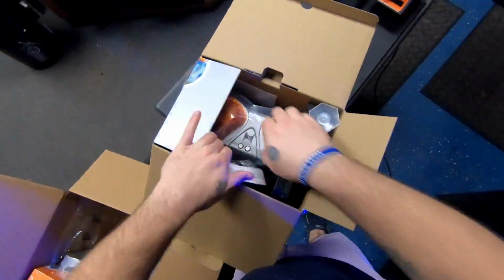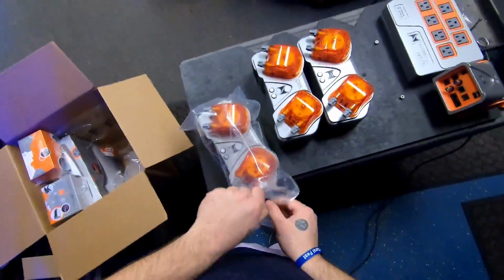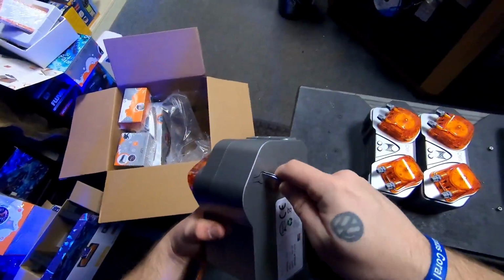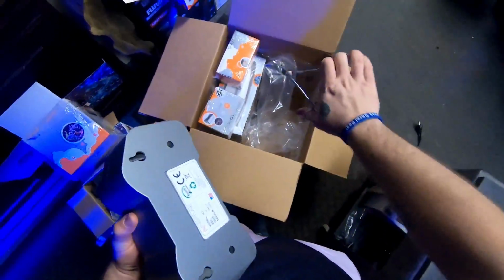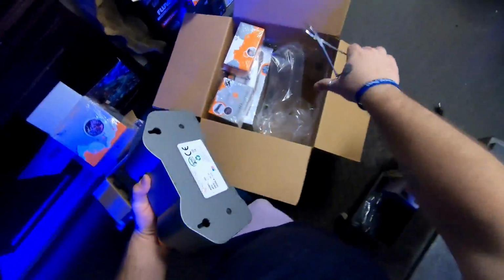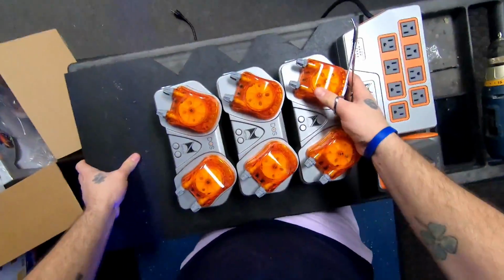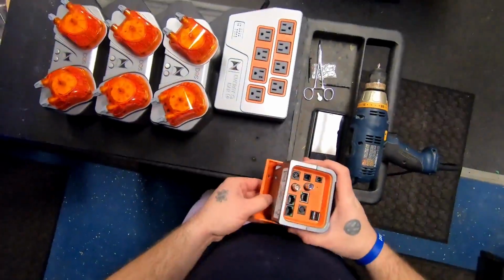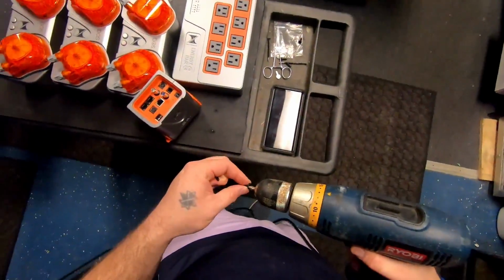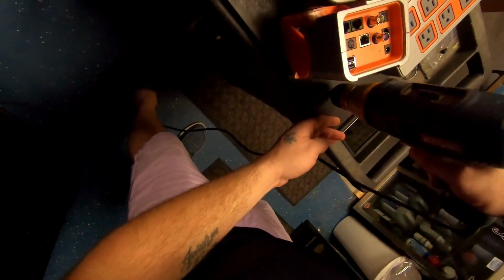So I cut these triangular holes for the wiring. Each one of these components has at least 1 wire, some of them have 2, and of course the wires have to be like 15-20 feet long or something completely crazy. So I use those as spots because I cut these boards to fit. Specifically, this one was for the back of a Reefer 350 to fit exactly in that hole. So I needed a space to get some wiring through and make it look clean, but I also wasn't trying to spend a whole bunch of time routering things out. So the triangles work just fine for my purposes, and all of the wires fit within those 3 just fine.